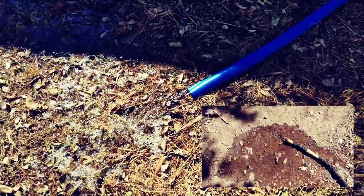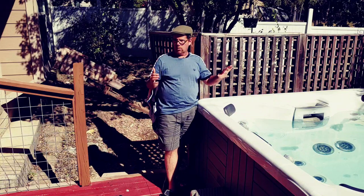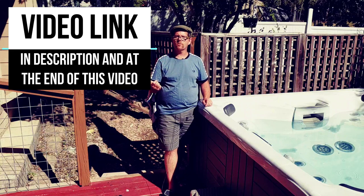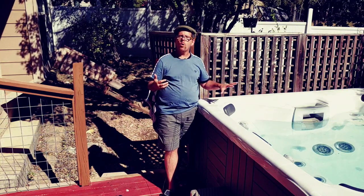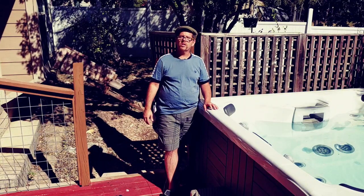I do have another video on the submersible pump, but that wasn't the purpose of this video. While the tub is draining, I want to briefly mention I have another video that talks about doing a biofilm clean out. I do that every single time I drain my hot tub, which is about every three months. The biofilm clean out gets rid of bacterial buildup inside the plumbing — because it's in the plumbing, you never know it's there. I do it right before I change my water, and when I fill it back up, my water is sparkling clean and clear with no bacterial buildup affecting the safety and sanitation of my newly refreshed hot tub water.